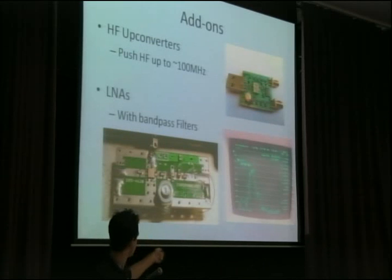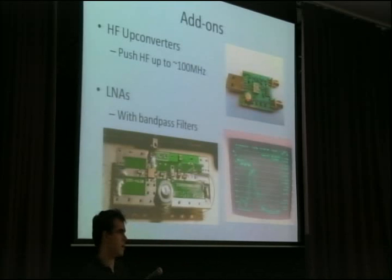This is a quick photo of something that I'm putting together at the moment for the ballooning stuff. It's up in the ISM band, there's lots of high signals around there, especially when a local amateur starts up with 400 watts of FM. It doesn't do much good when trying to receive this 10 milliwatt signal. So this actually has a SAW filter in the front.